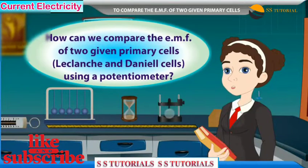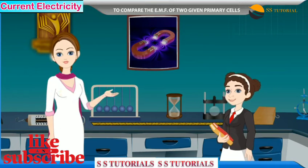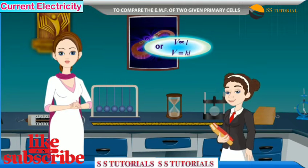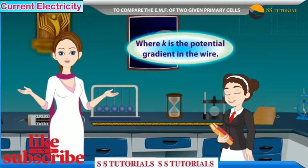Madam, how can we compare the EMF of two given primary cells, Leclanché and Daniell cells, using a potentiometer? When a constant current flows through a wire of uniform area of cross-section and composition, then the potential drop across any length of the wire is directly proportional to that length. That is, V is proportional to L, or V = KL, where K is the potential gradient in the wire.